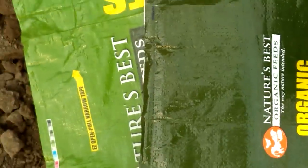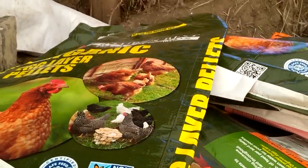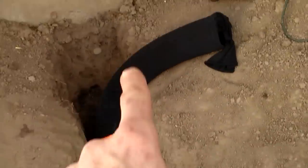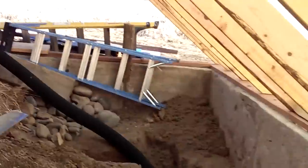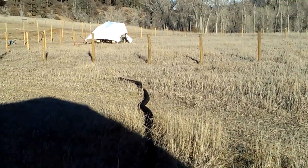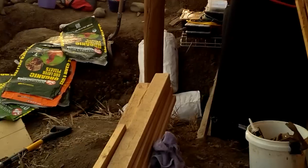What I want to show you is that we're taking these recycled feed bags — obviously non-GMO organic feed that we use for our chicken farm, this is what we supplement them with along with sprouted grain. I'm using these recycled bags for two things: as a vapor barrier to keep the heat from this pipe in the ground, and also to keep any mud or water from seeping into the sock. We're going to be lining the whole geo tube and then covering it with clay. When you buy these tubes, they come in rolls and are very hard to work with, so when you cut the roll open you really need to unroll it outside somewhere, or else it'll have kinks like a hose.